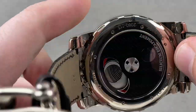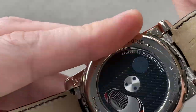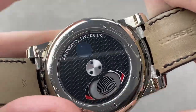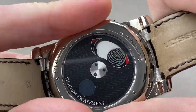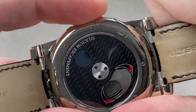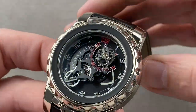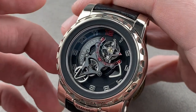Turn it over — lots to love. You still wind this watch with the case back. To wind the watch, you simply turn the case back, and each full rotation is the equivalent of about 12 hours of power reserve. This watch, with caliber 208, has a power reserve of between seven and eight days, and you can see how the coiling of the mainspring inside the case back acts as a sort of informal power reserve indicator. The longer you have the watch, the better you become at gauging the remaining power by the tightness and coil distance between the curves of the spring.